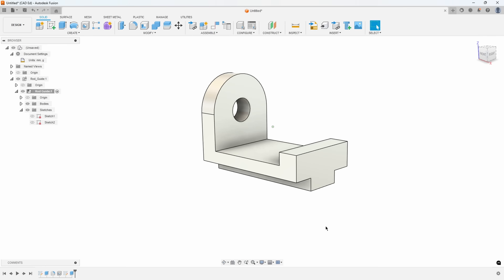Those are some of the things I think about as I'm designing parts: how can I simplify my sketches, how can I expect changes down the road, and how will that affect my design? Using full round fillet, using the hole command instead of a sketch, using constraints instead of dimensions so the hole stays centered, using the equal constraint instead of multiple dimensions. Hopefully this gives you some ideas. I'll probably create another one of these videos with a more complex design. Hopefully you learned something new, and we'll see you in a future video.